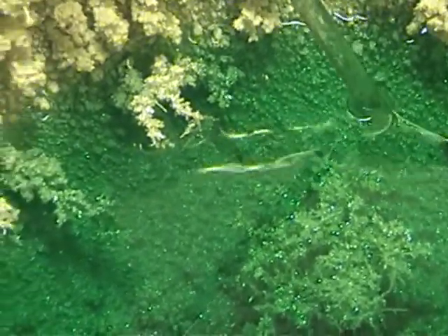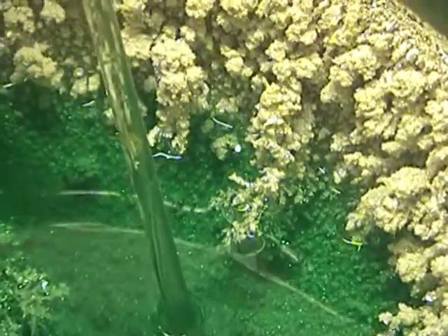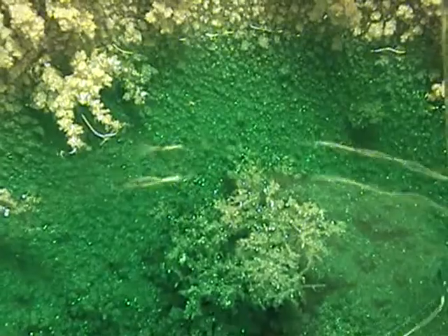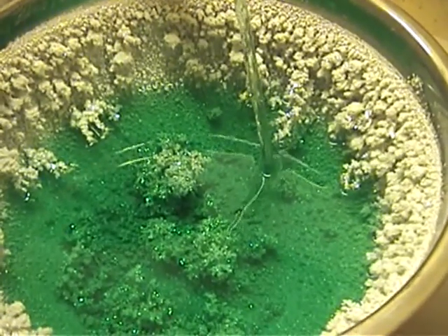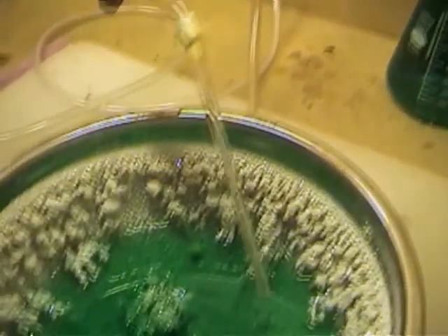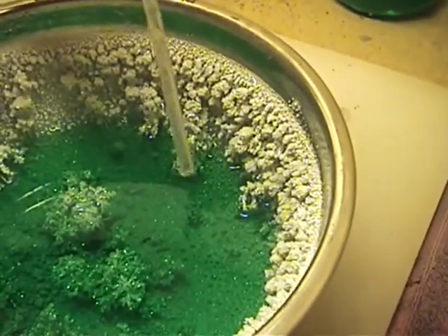That one's holding up pretty good. Our bushes down in the very bottom are also starting to clear the top of the solution. Oh, another collapse. Okay, that's another thousand milliliters of solution that we've drawn off now. You want to take your squirt bottle, hold it over your tip, and lightly rinse it off — most of it will be sucked up into the tip helping clean out your line.